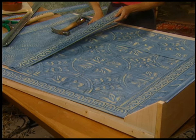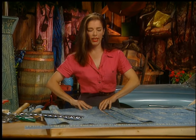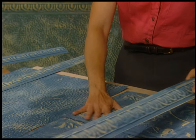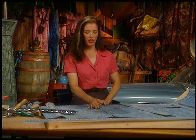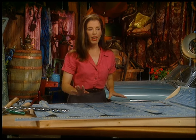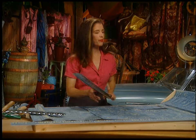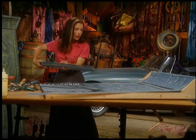This piece is called 'stipple' — it's made as filler. If you're doing a ceiling and you get to the edges and you're not ready for molding yet, you use this. These panels and molding pieces are a little more expensive, but still only about $16 for a big two-foot-by-two-foot panel, so it's definitely not that expensive to do a bed. I'll square all this up, then nail starting from the top down to keep everything square, then put the edge molding on the sides too so it's all trimmed out and looks very swish.